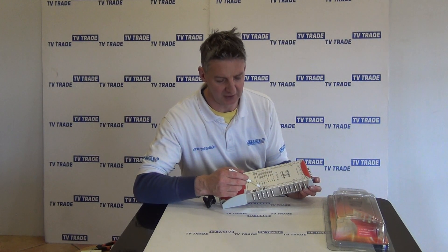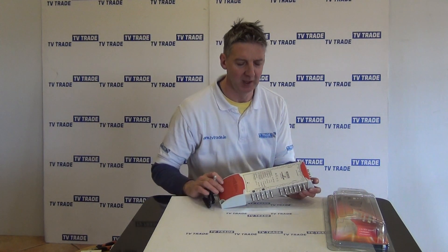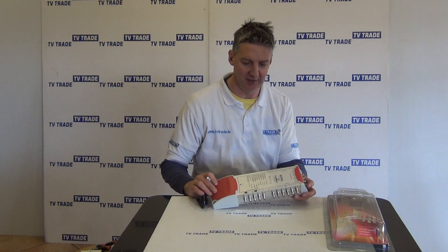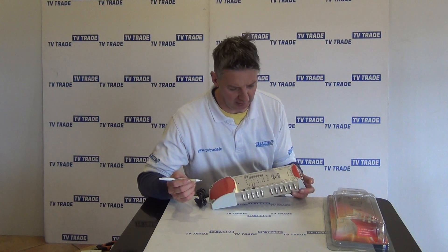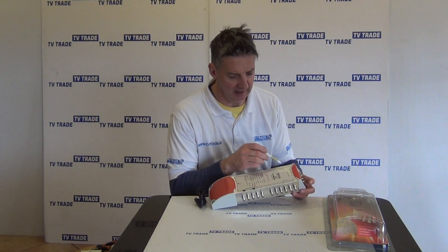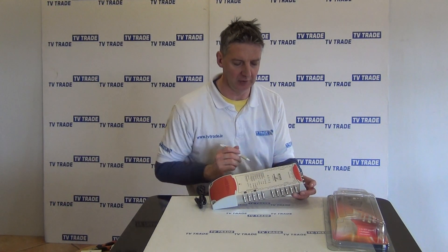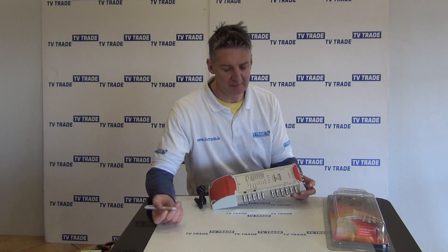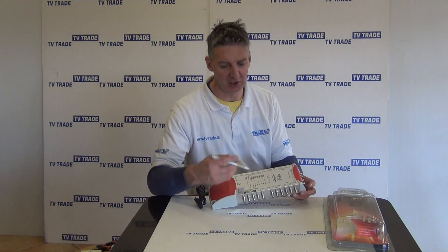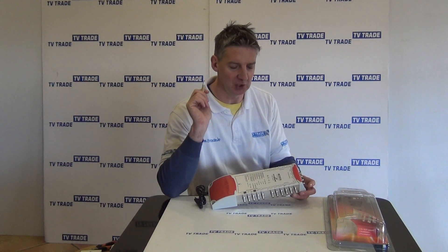You'll see corresponding to the vertical and horizontal high and lows mentioned, we can see vertical and horizontal low and vertical and horizontal high band inputs here. Looking at the outputs, we have a total of 16 outputs: six here, six here, and four along the top. This means we can feed the signal to 16 separate rooms, with a single cable running to each of those rooms.